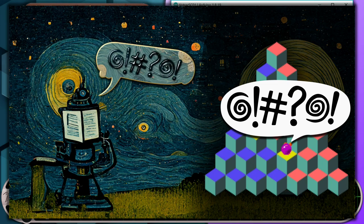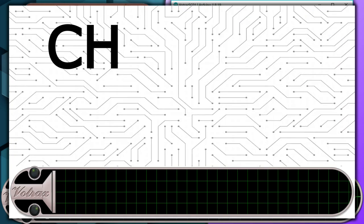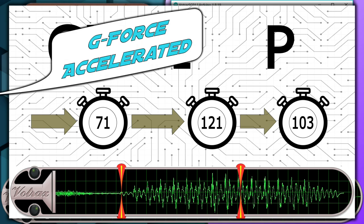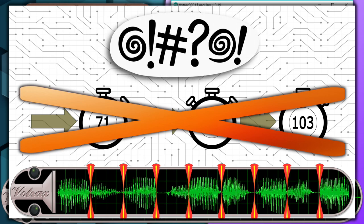To figure out why these sound different, we look at the Votrax phoneme chart's duration values — the average time each phoneme takes in normal human conversation. When the Votrax starts enunciating a phoneme, it sets a timer for its duration value; when that timer goes off, it requests the next phoneme, and so on. This keeps Votrax chatter running at a normal pace, which is why other arcade machines sound calm and unemotional. But an analysis of Q-Bert's cursed voice waves reveals that each phoneme plays for no more than 80 milliseconds and is then hacked off by the next phoneme — a subtle but clever trick to make Q-Bert's outbursts sound distressed.